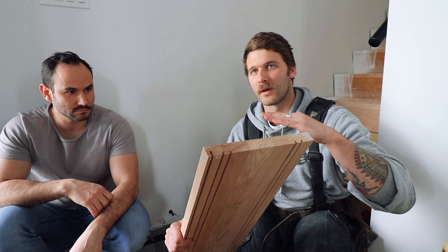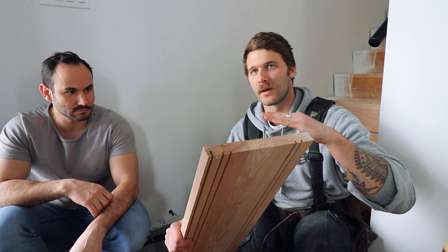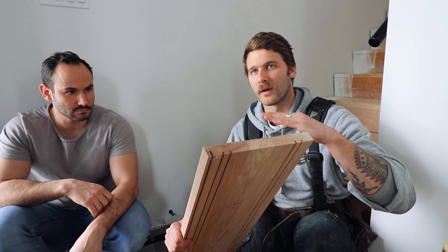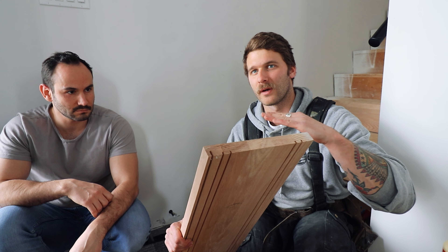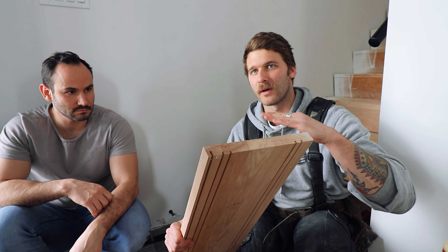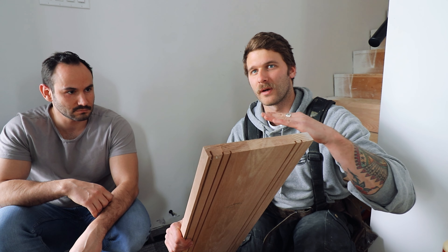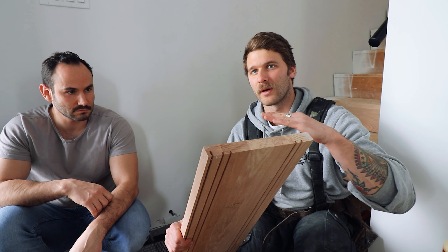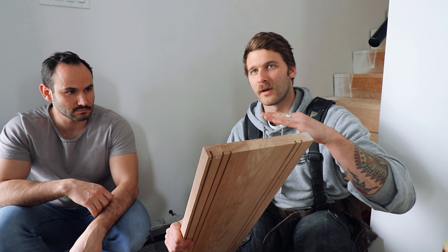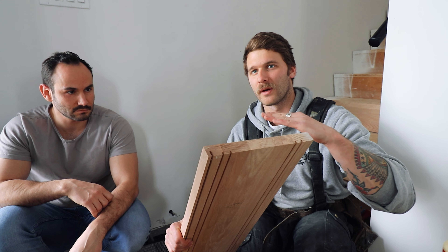At the back of the step, because our angle we found out was just a little bit too steep, we had to cut the store-bought treads — we had to cut the nosing off of them. That left us with a ten inch tread, and with our angle the way we had it designed initially we basically didn't have enough tread to have a tight measurement. So what we're doing is using paint sticks with PL and pins to shim out the bottom, leaving the top as is, and that kicks out the face of the riser at the bottom just enough to close that gap. That fits nice — it worked!